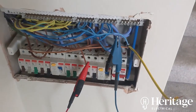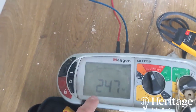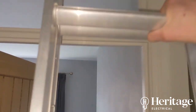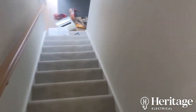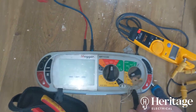Doing the insulation resistance test — at 250V between line and neutral I got a dead short, meter reads zero MΩ. The cable comes down from the loft, and checking up there revealed a hidden double socket supplying an antenna splitter/booster which was still in circuit. After isolating that socket, we're getting greater than 999 MΩ, and now we can go to the 500V test.